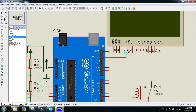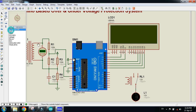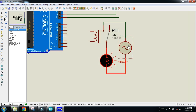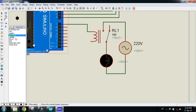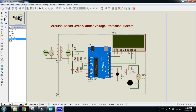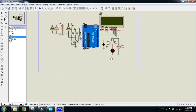Place the relay here. Connect the LCD and place it here. Connect the lamp with it — this will be the main load. Connect the alternator with it. Change the voltage value to 220. Connect the relay with pin 7 of the Arduino and connect the LED to pin 6. Connect the ground with it, and connect the ground with the relay as well. Change the voltage from 12 to 5V, as the Arduino can only control a 5V relay. Connect the voltage and ground to the LCD as well, then connect the ground.